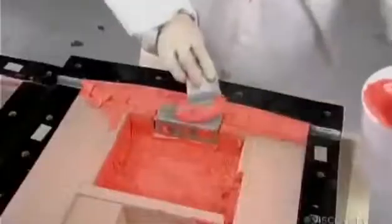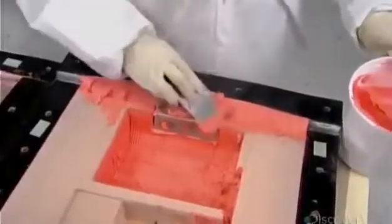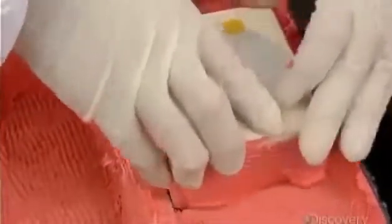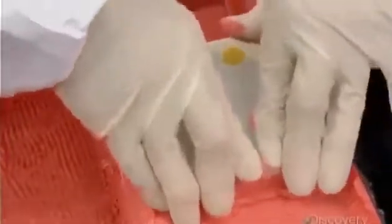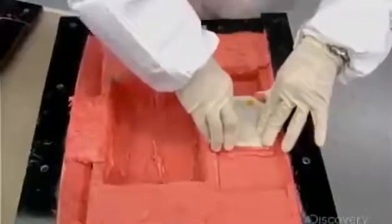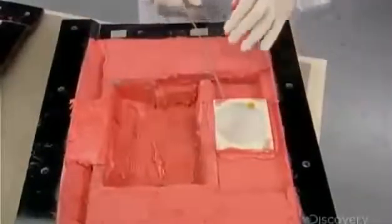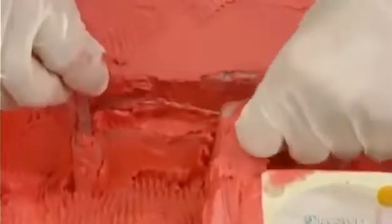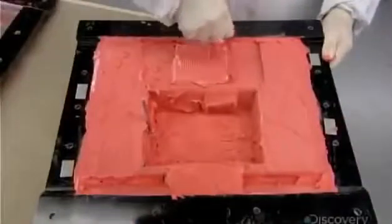Besides absorbing the force of impact, the foam core makes the flight data recorder buoyant should the aircraft go down in a body of water. The device contains 2 antennas, the first of which gets pasted into a designated spot in the foam core. One antenna transmits a distress signal, the other a homing signal to help search and rescue crews locate the downed aircraft.